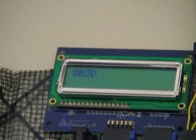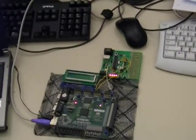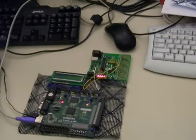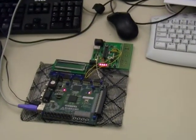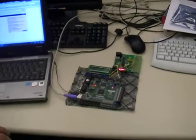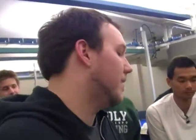One other thing of note is for the keyboard, to simplify the reading of the keys and to negate the auto repeat, we only read the key sequence after reading a scan code of F0, which is the break code. It basically reads only when you pull up the key, which simplifies it a bit. But that's our project.